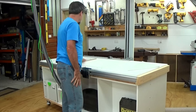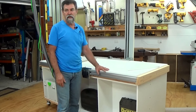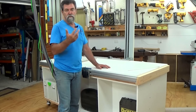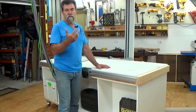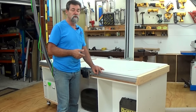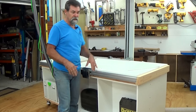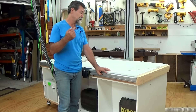So there you go - that's my little system. It wheels around wherever I want it. It saves me mucking around with moving things all around the shop and taking things off the table and putting them back. I'm not in a situation where it's getting a bit risky with the table saw sled for large panels. I've actually got the width where with my drop saw I can only cut around about 200mm, and with a sliding combination saw you're getting out to around a foot - 315mm - not going to cut it for what I just did. Sometimes you can cheat and tip them over and go to the other side and join the cut up, but you never get as perfect a cut as I just got. Tip from Dave: make yourself one of these babies and life will look up for you.